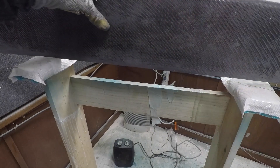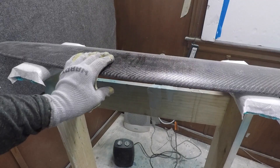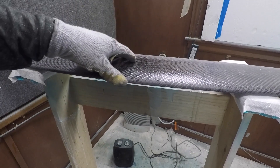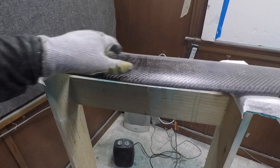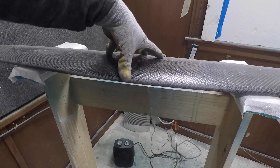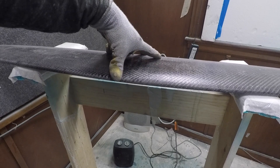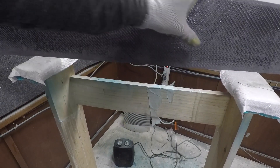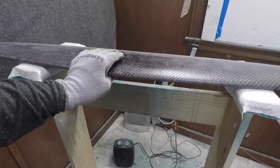Maybe just a center patch will suffice. We need to remember that once you put the whole tunnel area where the fuselage comes in, that adds a lot of stiffness — it really stiffens up the center of the wing. So I think between the tunnel and a patch more towards the center, I'll have the stiffness I need.